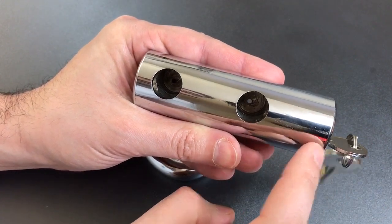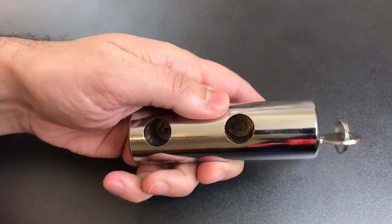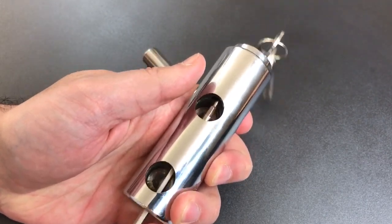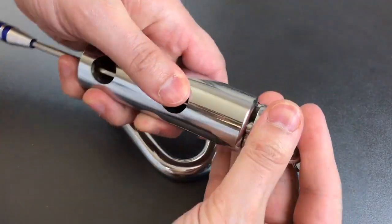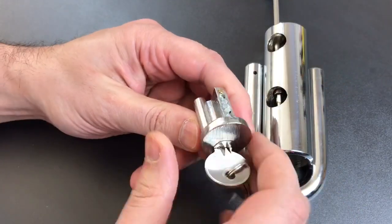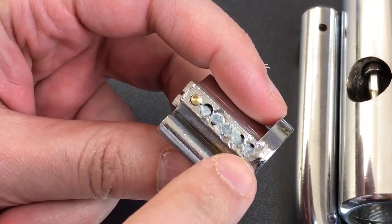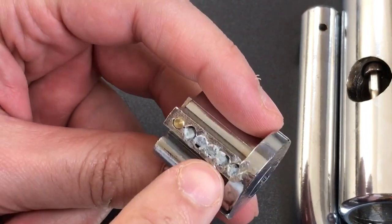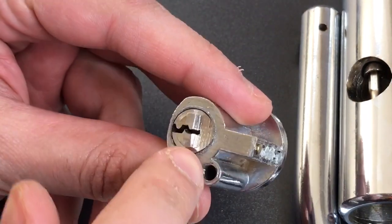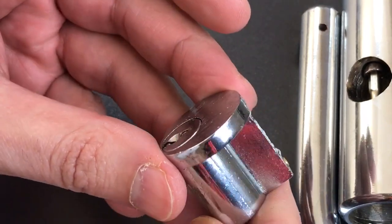To take this core out, what we need to do is reach through this hole and all the way down the lock body to the screw that holds the core in place. Okay, so we've got this core out, and it is really, really bad looking. You can see each of the pin chambers is capped off with — I'm not even sure what that is, looks like mortar or maybe pancake batter, who knows. There's no clip on the back. This is actually held in place with this brass pin, and the entire thing appears to be made out of pot metal.